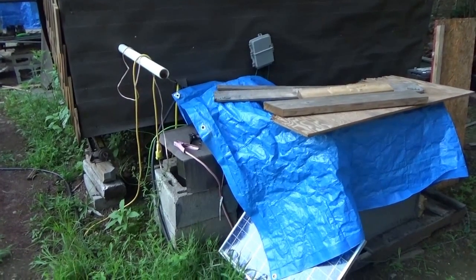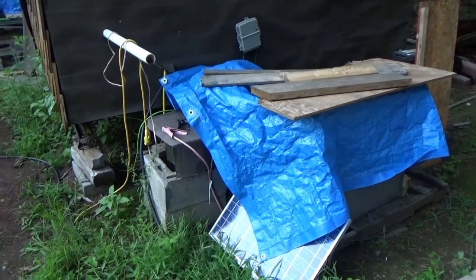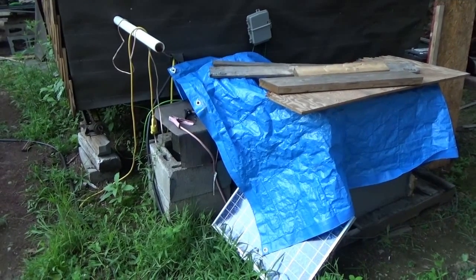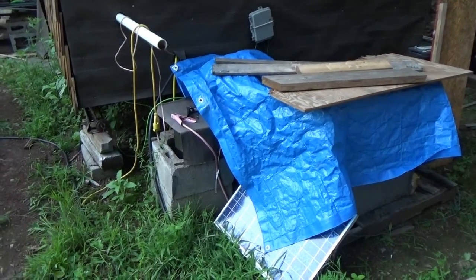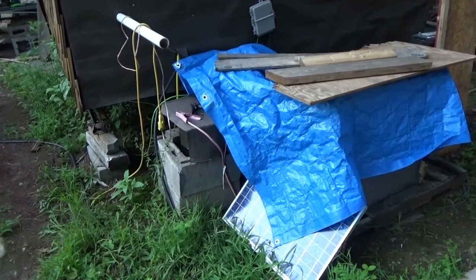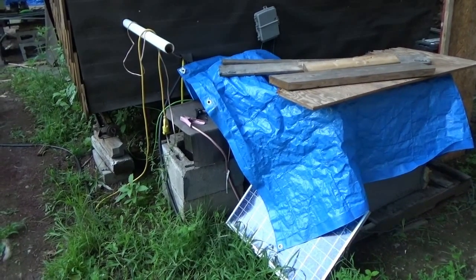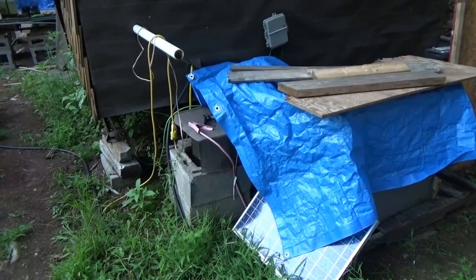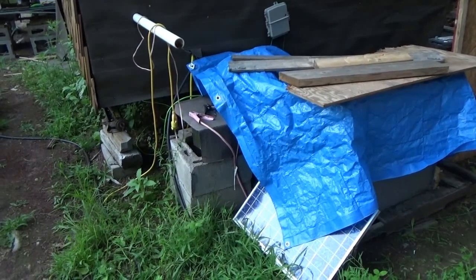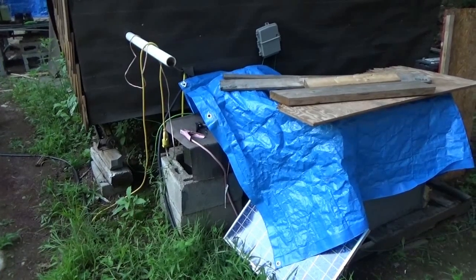I am no longer checking specific gravity because they are never full — not because of lack of solar power, not because I'm using more power than I'm putting in. There's just something wrong in the chemistry because they're never above 12.2 volts. When I was gone to Ireland and Michigan and came back, this battery was still resting at 12.2 volts with no load for an entire vacation period in full sunny days. So the forklift battery definitely is not top notch, but it's doing everything I need it to do right now.